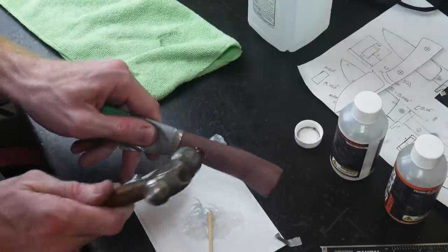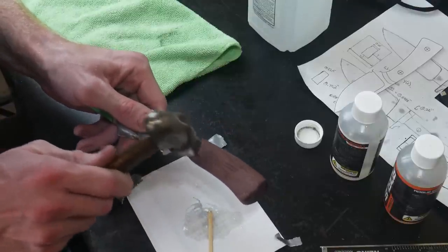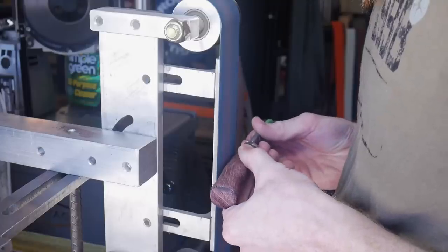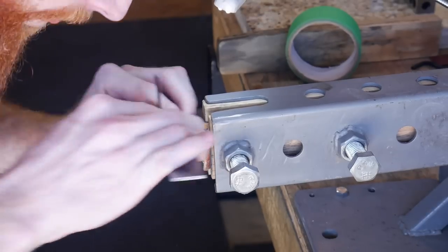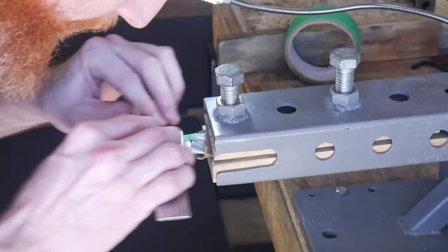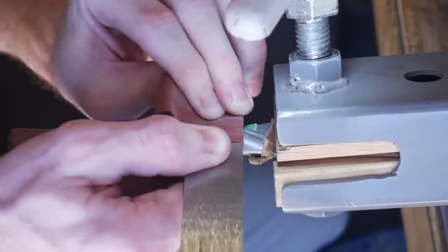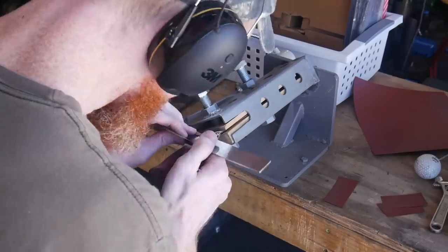After getting the bulk of the handle shaping done, I figured it's time to put in the pin — a slightly tapered stainless steel pin that will be epoxied into the handle. Once I gave it time to dry overnight, I cleaned up the ends of that pin on the belt sander and then with some hand sanding. To make sure the pins are not domed, I use a piece of metal as hard backing behind my sandpaper so it stays nice and flat. I also used hard backing for the transition between the guard and handle material so the sandpaper doesn't eat away the handle material faster than the guard.